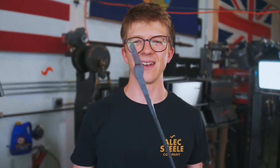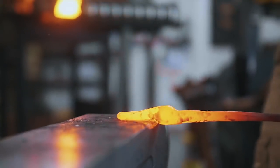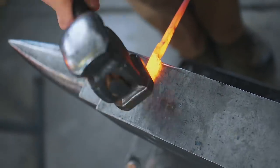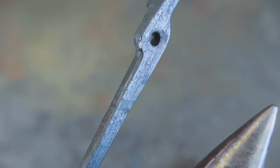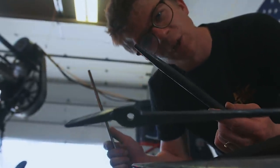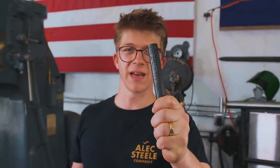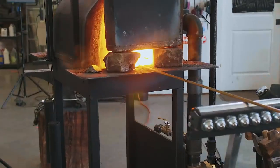What we're now going to do is draw it down thin, punch a hole, and sort out this whole area. We punched that hole with a 4140 punch — about a little less than a quarter inch. If you're after steel for making punches, we've got some cut to length. That hole is a little bit undersized, so I have our final quarter-inch bar — the same stuff we're going to make the rivet out of — to use as a drift to open it up. I can never find my drifts, so I always have to make new ones anyway.